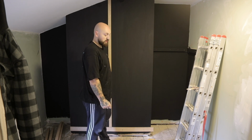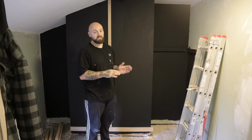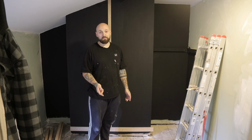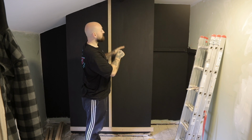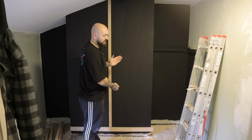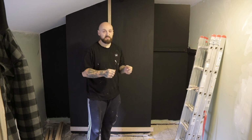across, obviously when the skirting boards are ready to go in, and then I'll just cut them all off and the skirting board will slot in anyway, so it just makes it a little bit quicker and saves having to double cut each one, well triple cut each one, because I'm currently cutting them so they'll fit in there, scribing them in, and then obviously having to then cut them to the height of the skirting board. So it just takes out an extra step, and then it's dead easy just to run.